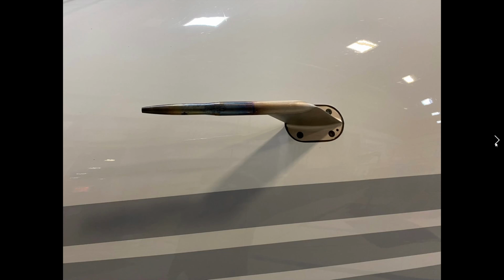The next thing you're looking at is the main pitot tube, and as you can see, it's been pretty hot, and we can see discoloration. Obviously, we're looking for whether it be this pitot tube or this pitot tube, that the hole in the front is absolutely clear. So I'm going to shine my flashlight in there. I'm physically going to touch it. It's not hot at this point because the airplane hasn't flown. So making sure, I'm really into the tactile thing, making sure that things are in fact correct. And